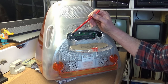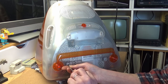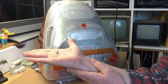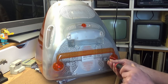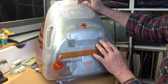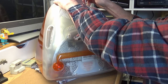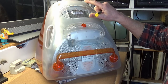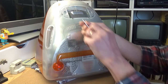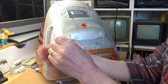Fortunately, opening the computer is actually quite simple. So let's go ahead and do that. Now there are a couple of screws here to take out. These, by the way, are just very small. Two on the bottom here. And now we remove another trapdoor. If you get a flat-bladed screwdriver just into this little opening here and pry it, you will find this flap comes off and reveals the external monitor port. Set this aside. There are two further screws here. And these are larger.